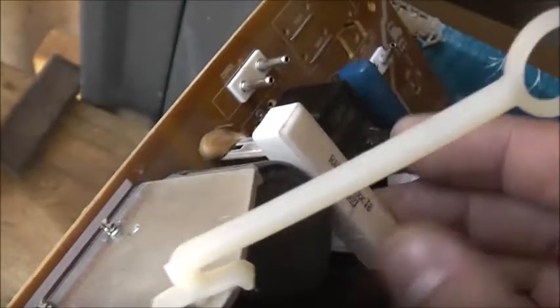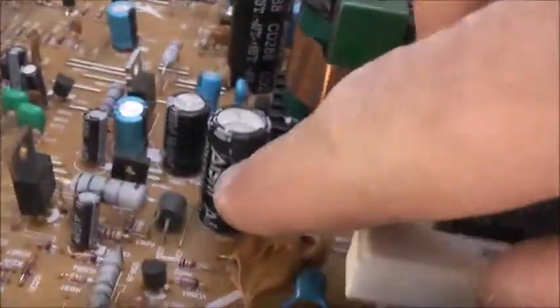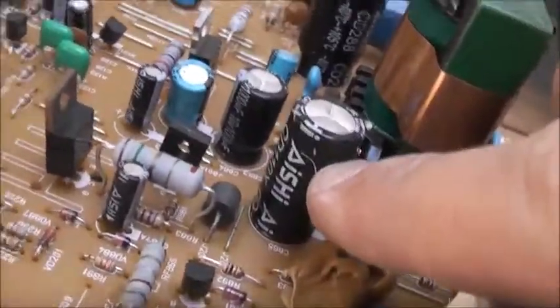Of course I kept these boards, kept the flybacks. It's a Chang Hong flyback. This has got a 450 volt 220 microfarad capacitor as well. That's alright. Thermistor, they're quite useful, those. Another capacitor here, TLC, a cheap brand there. Another capacitor here. Oh, that's using CFLs. Damn it, this brand is shit. Stay clear away from it. They're using CFLs. I've seen a lot of this brand of capacitor go dried out and go bad. They are crap.